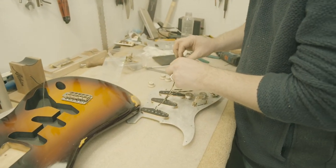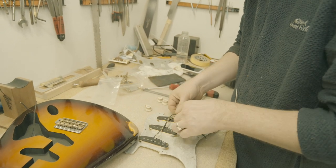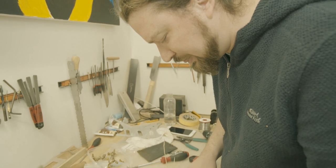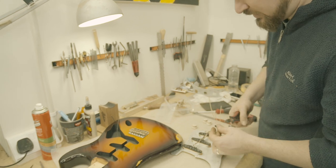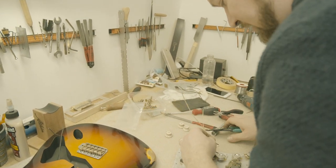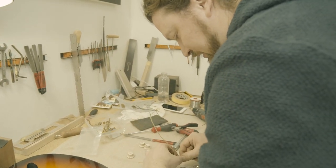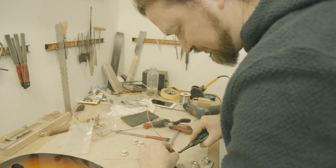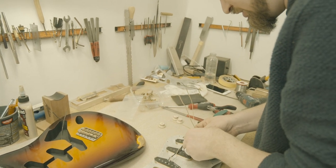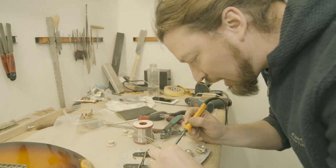Twisted wires — this isn't just to look pretty, though it does look pretty. Because one wire's earth, it does add an extra layer of shielding as well, so it will cut down on noise ever so slightly, and that's good. We've got this nice vintage pushback wire — it's really cool to work with. You don't have to strip it; you just cut it and push it back, then you can slide it back again so it perfectly lines up with your joint. It's very nice material to work with and it looks cool. I'm going to get some solder and prepare the back of the pot.